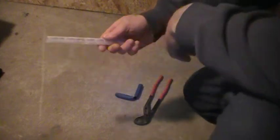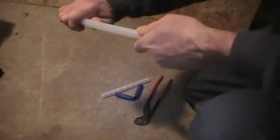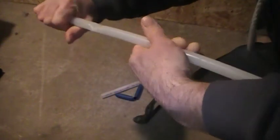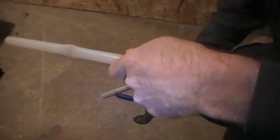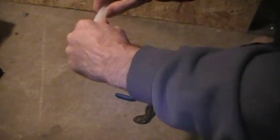You can see there it's going back to its original color; it's still fairly warm. I have another piece of PEX right here, and I'll just bend this about a dozen times to see what happens. 25 times and still nothing. So it's pretty amazing the difference between the A and the B. But that's just a little demonstration I thought I'd show, and there it is going back to its original color.